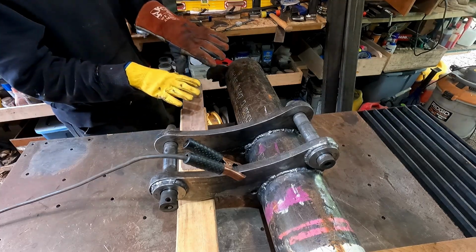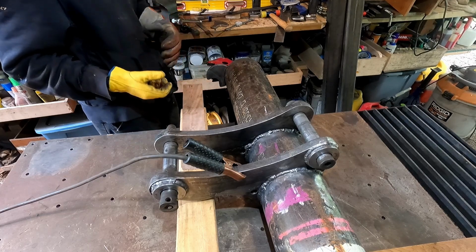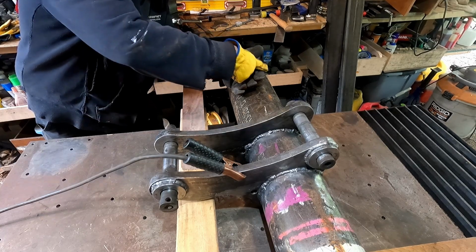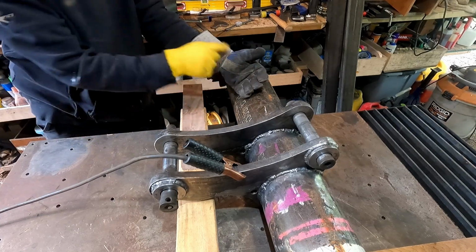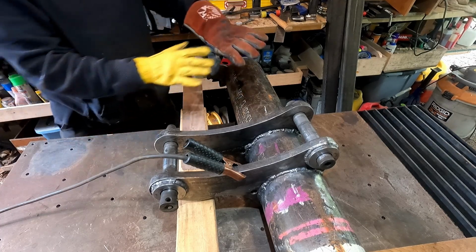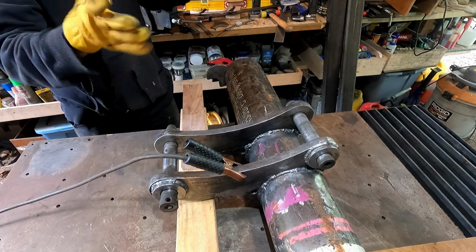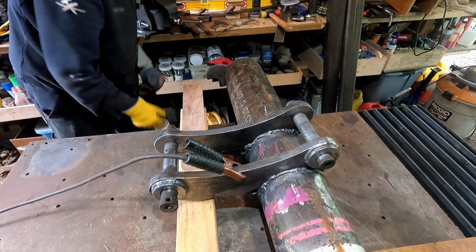And if you're wondering about the two gloves thing, I like the thin work gloves for the dexterity for running the torch, but quite often you pin the knuckles of your left hand to the workpiece and then use it as a rest or a guide for the welding torch. And that's hot, and there's a lot of weld splatter that gets around the end of the shorty gloves and things. So I find that a big, heavy, thick welding gauntlet on the left and a thin work glove on the right works pretty well. Just looks funny.